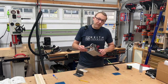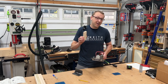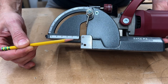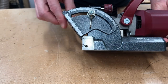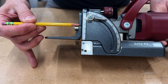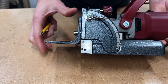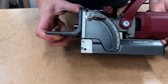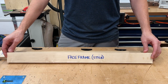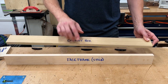If you'd rather not swap between using the swivel fence and installing the stop square for that second row of cuts, here's a way where you can just use the stop square and a spacer block to cut both rows of slots. The way this machine is designed, the center mark where your slot will be cut is 10 millimeters down from the swivel fence — set to be centered on a piece of 20 millimeter material. If we fold this up, lock it in place, and install our stop square, you can see this arrow here points to the designations on the scale. If I slide it all the way back to 10, I'm back where the swivel fence would be, but I want to offset that 20 millimeters — that will be our scribe width — so I'll bring this up to 30 and lock it in place. Here we have a piece of hard maple as our face frame outside stile that will be scribed, and a piece of plywood representing our cabinet box.